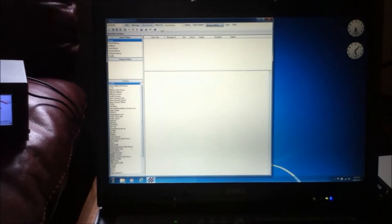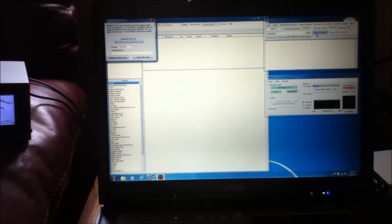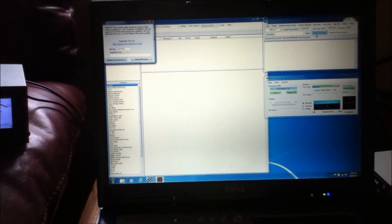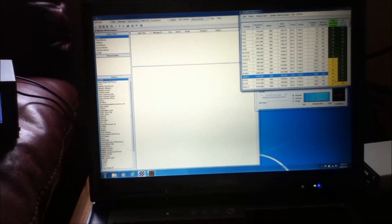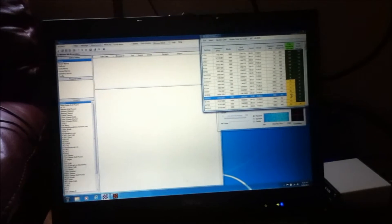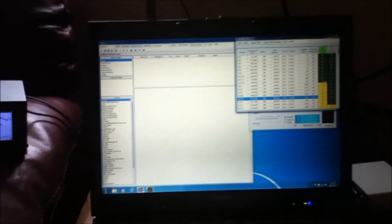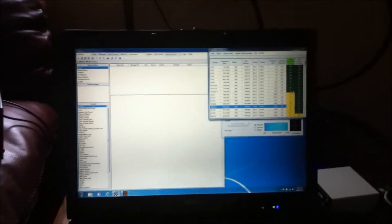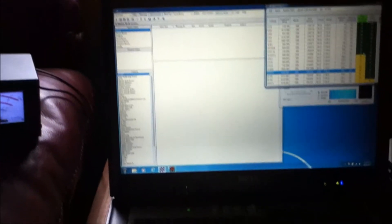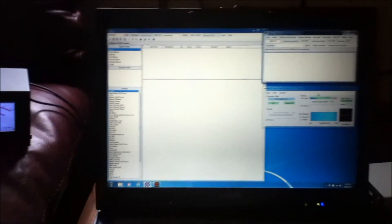I'm going to go ahead and post that to my outbox and transmit on the HF frequencies — that'll be on 14.1025 megahertz. In the propagation window, it's showing about 65% path reliability. The other stations with higher reliability are either outside of my bands where I don't have an antenna, or they're too close to me so I'd over-bounce them. I'm going to select this one — it's 1665 kilometers away, in Coronado, California. I'm up in the northwest of the United States, near Seattle.